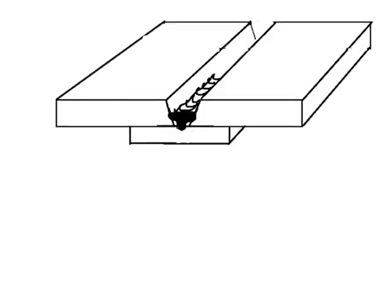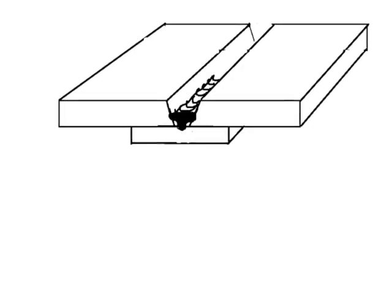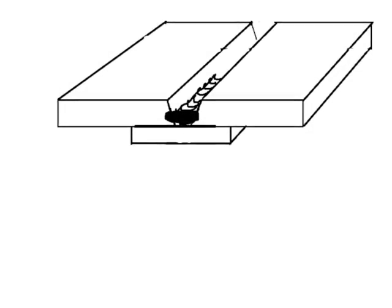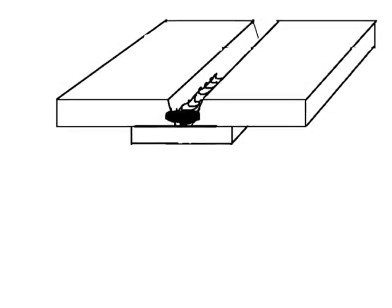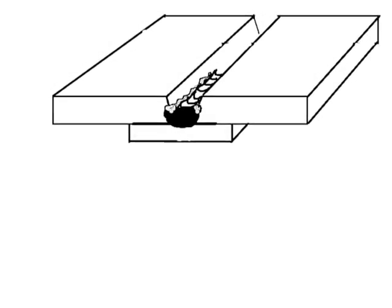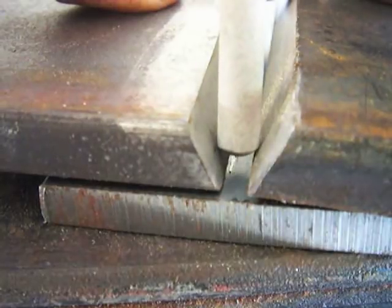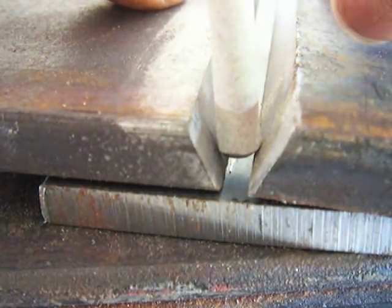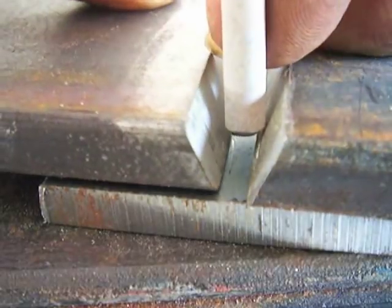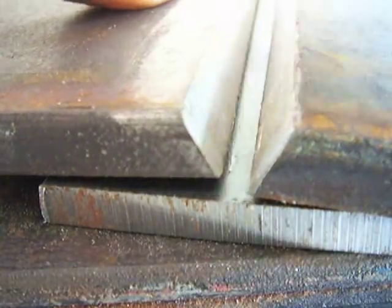What you don't want to do is penetrate into the walls and the backing strap but leave voids on either side — lack of penetration or slag inclusions. You don't want to penetrate deep into the sides but leave slag inclusions against the backing strap, and you don't want undercut on each side that can't be burned out with the next pass. If you don't gap it wide enough, the tip of that rod is just too far from the backing plate to burn in that deep.